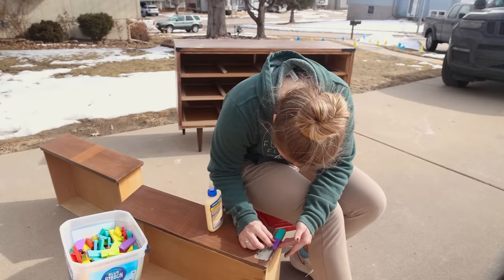For this dresser I decided to go very bold. We are going to be using Midnight Green in Dixie Belle's Silk Paint line. This line is all-in-one so it's going to have the primer and the top coat built in, but it's more of an adhesion primer which is why I went ahead and did the stain blocking primer separately. I'm going to do two to three coats of this for full coverage and to get the most use out of that top coat. Can you tell that March is near? We've got green paint, green jacket, and green eyes — St. Patty's Day, here we come!